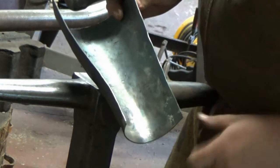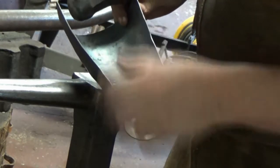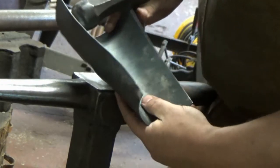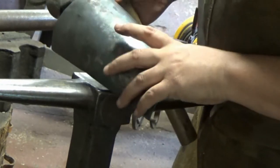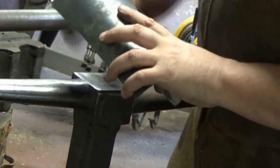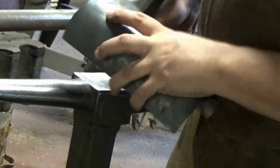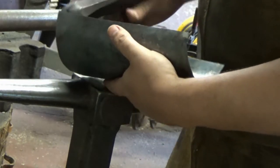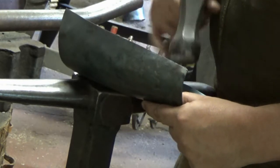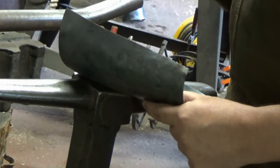What tends to happen on the inside — and you can tell when you're working in the correct area — is you get little bits of hammer scale tending to flake off as that material has been deformed, and you know you're in the right space. Another technique I use is to put my finger on the space, offer it up to the stake, then take my finger away and I can see there's a slight raise on there just from the way the light is coming off it, and I'll just work that back.